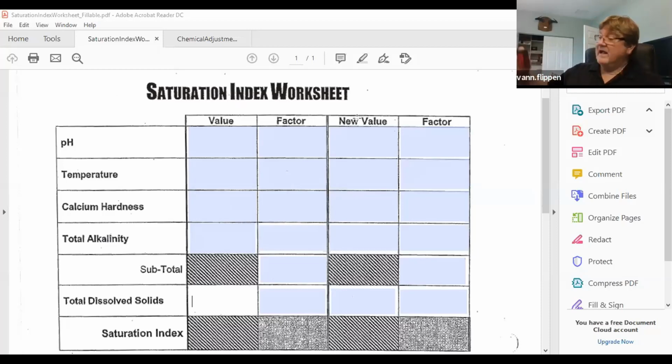I need to get the pH down, so I need to add acid to the pool. If I have two other red caps in my box, one is an acid demand reagent and one is a base demand. So this pool is demanding acid. So what I want to do now is add drops till I get that color change back to an orange.